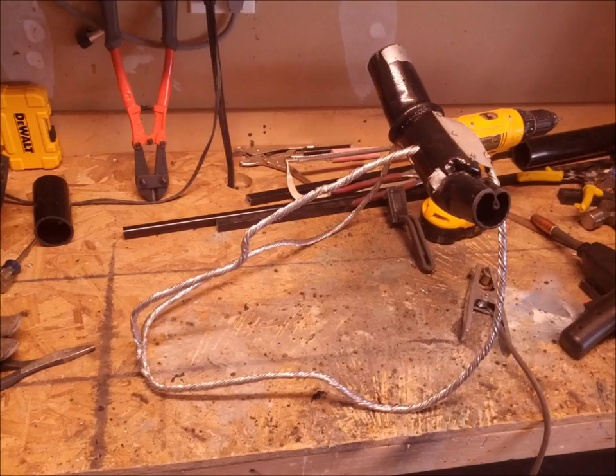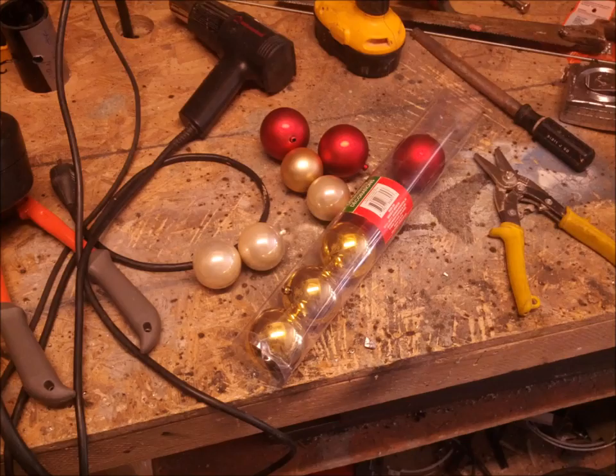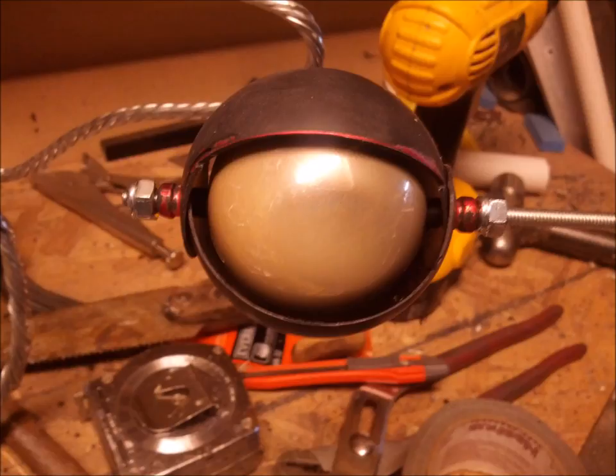Now on to the head. The head starts out much the same as the body but I integrate two-inch ABS plastic to be the mount for the authentic bull horns. I then cut aluminum pieces to create the roof of the mouth and functioning lower jaw. For the eyes I use — yep, you guessed it — Christmas tree ornaments, because they are plastic and spherical. One is slightly smaller than the other and they have a little protrusion for the hanging hook. I use the smaller sphere as the eye and half of the larger sphere for both the upper and lower lids.